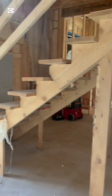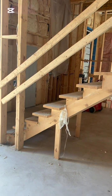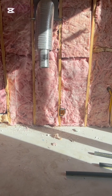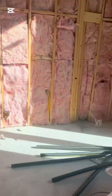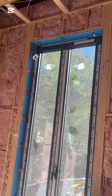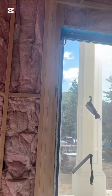You can see my switches are neatly supported on both sides according to code. This area is also filled with security wiring. There's going to be a built-in heater here. As we go around the ceiling, you can see my wires with two-by-fours placed on top to stop nails from puncturing the wires once they start to finish.